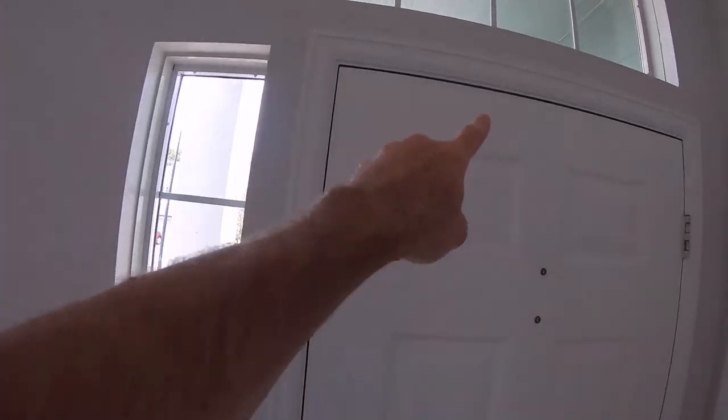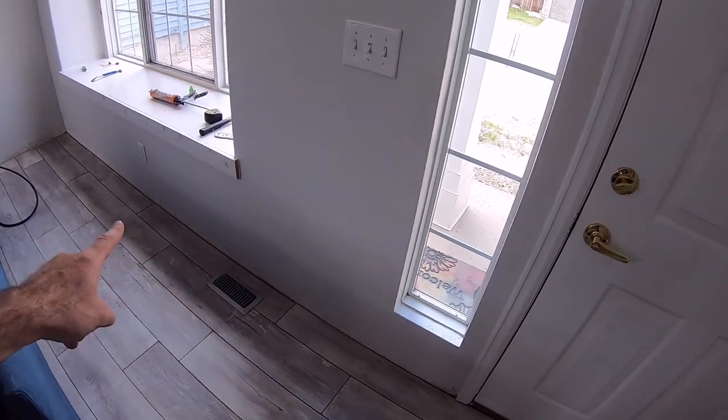And then once the walls are in, if you have this luxury, which we do, we're doing new trim, okay? So I did actually put some of the casing back up. And then we're going to come back in with base trim after all the walls are rolled. Again, that's so we can actually roll down. We have the floors covered. We can roll down as far as we can without having to tape off all of the trim.